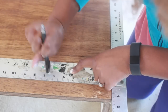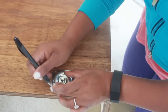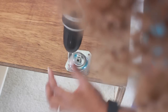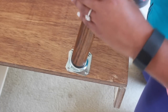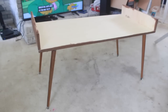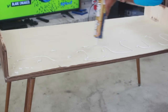I'm positioning the brackets at one and a half inches by six inches. I initially marked them at five but later moved them to six inches, and it looks totally better with them a little closer to the inside. You're just going to start marking the holes for where you want your screws to go. The brackets actually come with screws, so no need to purchase extras. You're just going to start screwing in the brackets for the legs, then go ahead and start twisting your legs into the brackets, which are now on an angle. And that's how it looks standing all the way up.